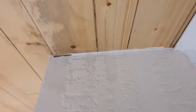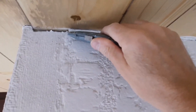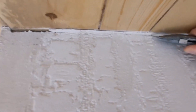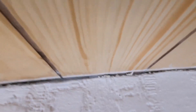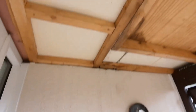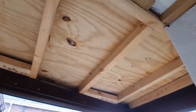I'll show you this — using the Stanley knife I'm just cutting along the paper so it's a lot neater to fix. The board goes underneath, and if I'd just ripped it out it would have made more of a mess than cutting the paper. That didn't take long — not bad. Got a good surface to work with there.